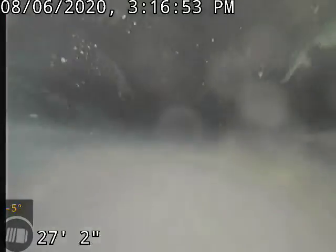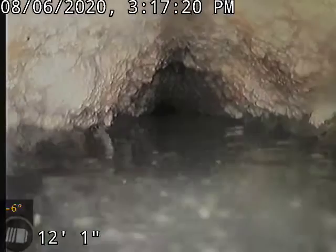Starting here, you can see I've located this belly where it starts and stops and marked it in white paint. You can see how it's holding water and it keeps getting deeper — there's kind of a 20 to 25 foot section here that has no slope, a belly holding water. That should be disclosed.